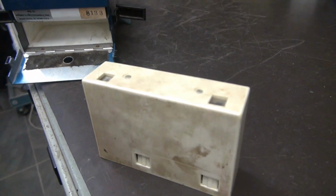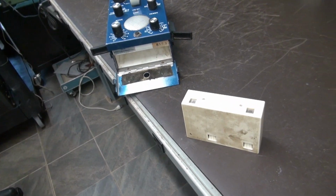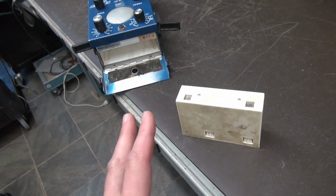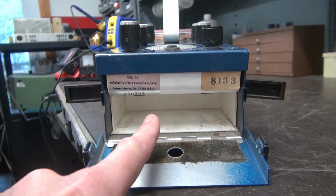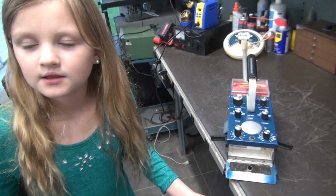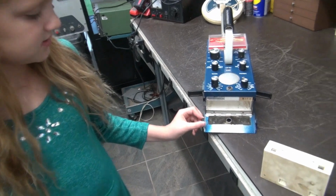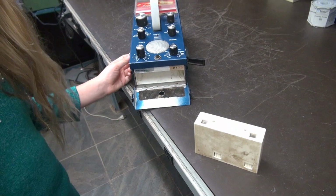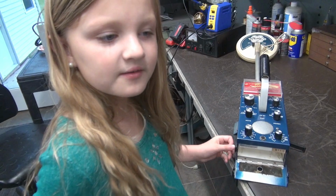Okay. So probably the first thing we should do is I'm going to show you how to use a DC meter, and you can check the voltage that's here. We'll make sure that it has voltage, right? Because these make contact with those contacts in there. And it must be the scratches that's making it. It very well could be. It could be getting a bad connection there, or the batteries themselves may have bad connections in the battery pack, right? So let's check that. Maybe the actual batteries have. Batteries could be bad too. I'm going to show you how to figure that out, all right?